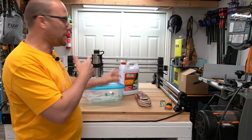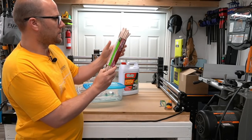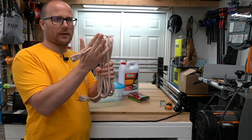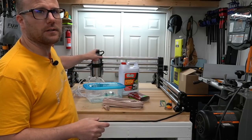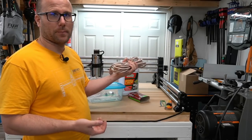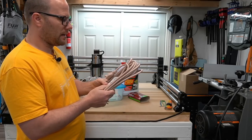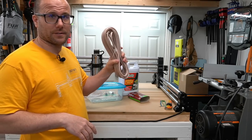That spindle comes with no wiring. So I bought some light duty 16-gauge 25-foot extension cord from Ace. What's really weird at Ace — if you look at cords without a plug on the end, they're like three times more expensive than just buying an extension cord and cutting off the end. I bought a 25-foot one because we need wire going into the VFD, from the VFD to the spindle, and from the VFD to the power outlet. If I cut this in half, I get about 13 feet for both — surely that should be long enough.